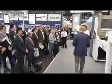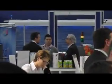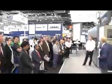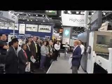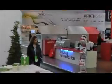So when you kick the machine off for production, it picks up the substrates from here, and they're transported on a conveyor belt all through the machine. It doesn't stop-start, and there's no 300 tons going up and down. It's really simplified. It's gripped on the gripper edge from the press all the way through the machine, so you get great registration. The first thing that happens is the substrate passes between the nip of the 2 rollers. On the upper roller you've got the crease lines, and on the lower roller there's a special substrate that we've developed. It's like a blanket, it's a soft substrate, it's a counter that you can use many times. Very, very simple and fast process.